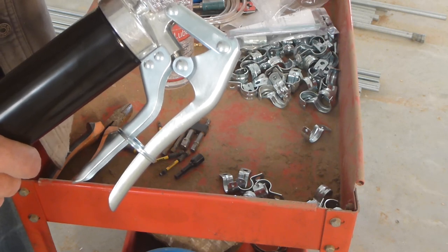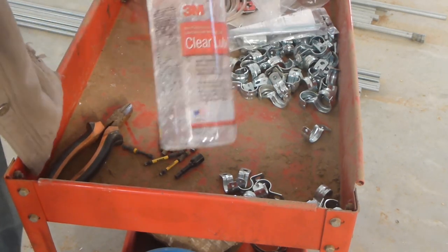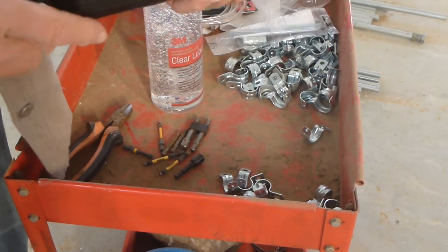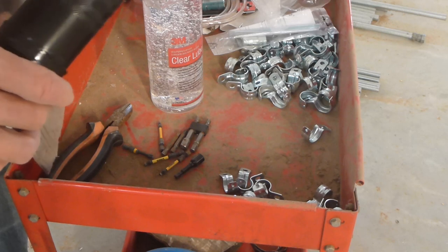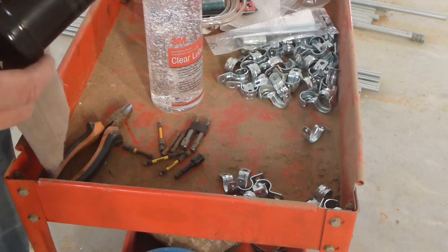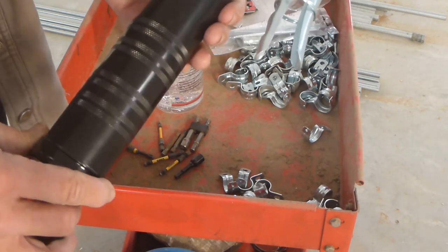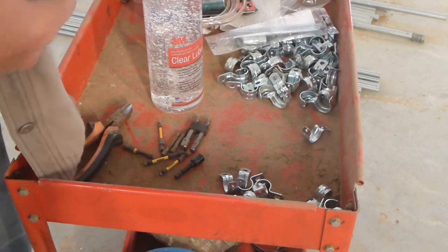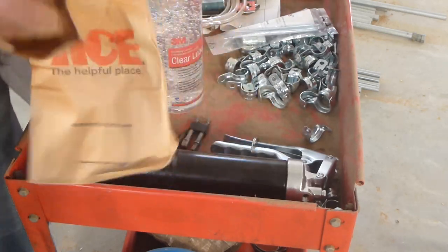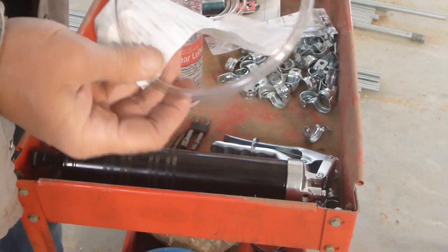I'm going to fill this because it'll work with bulk grease — hopefully it'll work with bulk lubricant. I bought a brand new grease gun because I didn't want to contaminate it with grease. There's some concern about whether THHN is oil and gas resistant, and I don't want to find out six months from now when I start tripping breakers because I'm blowing arcs in the conduit. So I need an adapter to go to this tubing — a one-eighth-inch male national pipe thread to a three-sixteenths-inch hose barb fitting.